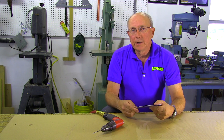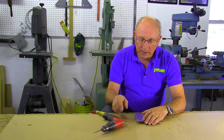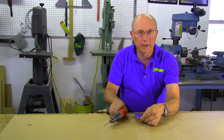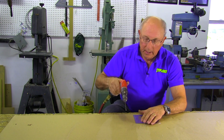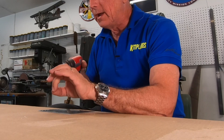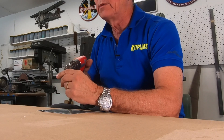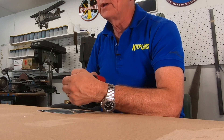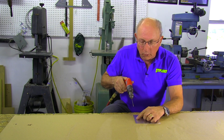Some tricks you might want to use: make sure that you're not pressing too hard when you have thin sheet metal because you can actually end up creasing it a little bit. Let the drill do the work. If the drill isn't moving and actually making chips, your drill is probably dull. If you push too hard, you can actually end up overheating it and deforming your sheet.